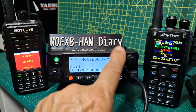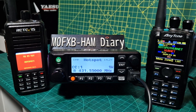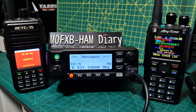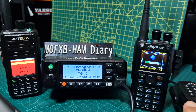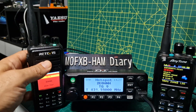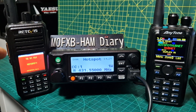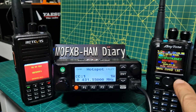You can see hotspot. So imagine this is an MMDVM hotspot. We're using the Blue DV system as well, but we can use PiStar. And it's transmitting a signal from the Brandmeister system to either my AnyTone 878 or any other DMR radio. This RT3S or UV380 is also running the OpenGD77 firmware, but this is acting as a normal DMR radio.